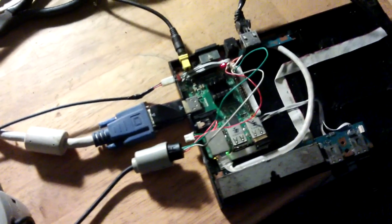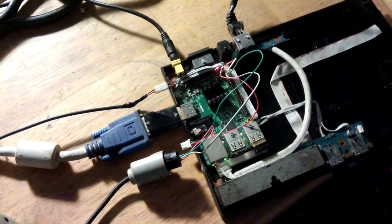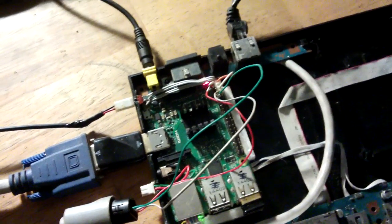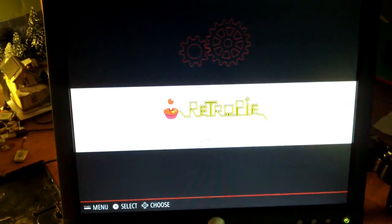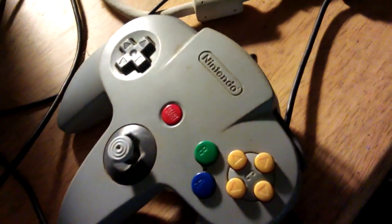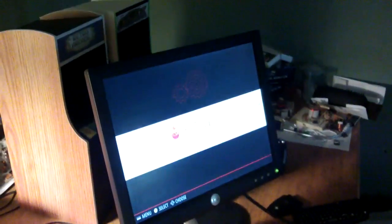This is quite exciting. There's a script I found that enables you to use N64 or PlayStation controllers from the GPIO pins, and it's simply in the settings of RetroPie. There we are with the intro screens loaded up in EmulationStation. Here we have an N64 controller — those three wires are 3.3 volts, ground and data. And you can see, if I go left and right, it's actually working.